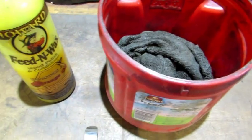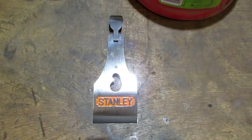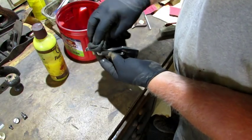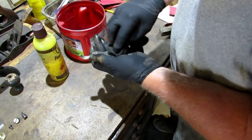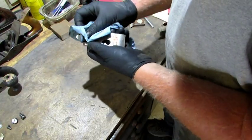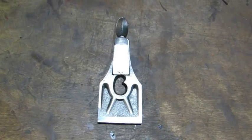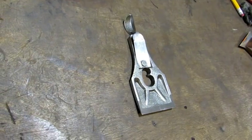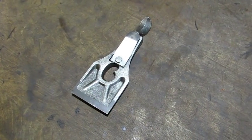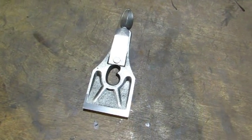The next thing to do is unleash my dirty oil rag. I buy it at Home Depot. I'm going to put it on that lever cap, every nook and cranny. You've exposed metal that hasn't been exposed before on this lever cap, same as on all the parts in this type of restoration, so you've got to get something on there to stop them from rusting. After that nice thick coat of oil sits for a while, you're going to wipe it off with a blue shop towel, and any place I can't get with that I'm going to use some Q-tips. What I like about the dirty oil is it gives the back side a little more aged look. My dirty oil is dirty because I've used that same rag for probably six years — it picks up rust, dirt, and grime mixed in with the oil and gives you a nice effect in the end.